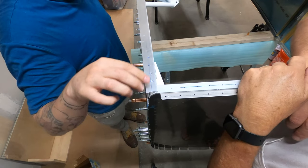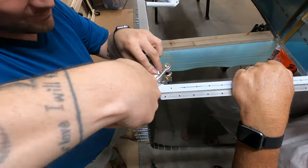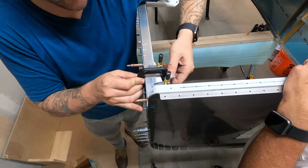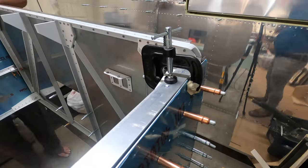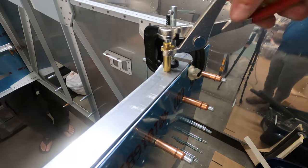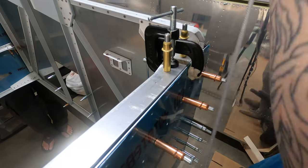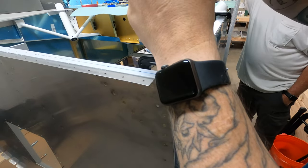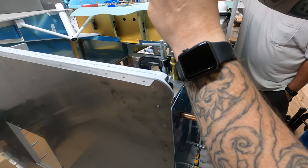Let's make some holes. This footage is older, but it's a part I definitely wanted to include in my videos — as you can see, this is back when my father was still here. Drilling these holes is a huge part of tying in the lower longerons, tying the firewall into the main structure. It's incredibly important to make sure you have edge distance on all of those. The last thing you want to do is plop those holes through and find out that on the weldment underneath you don't have the space required.